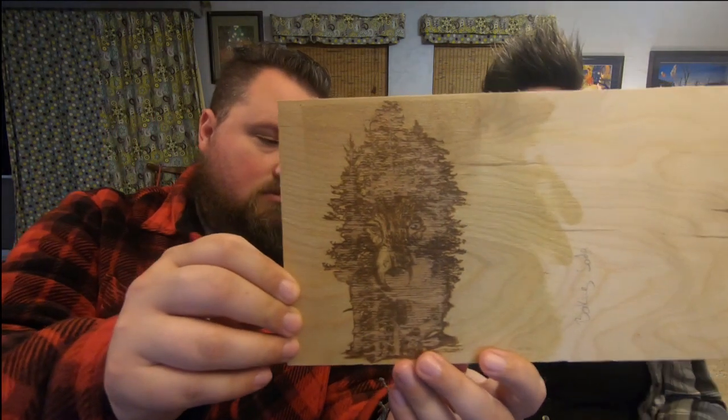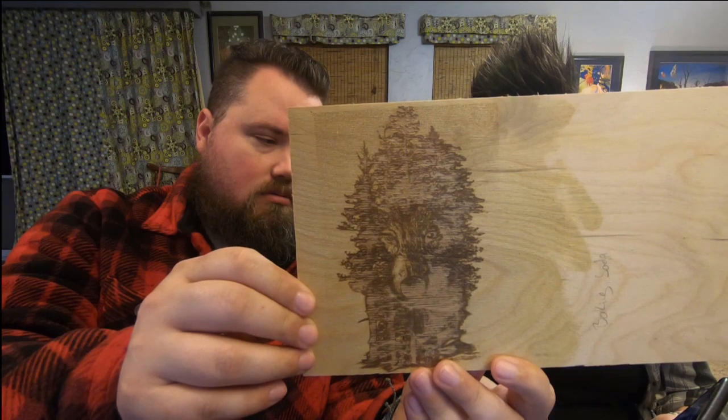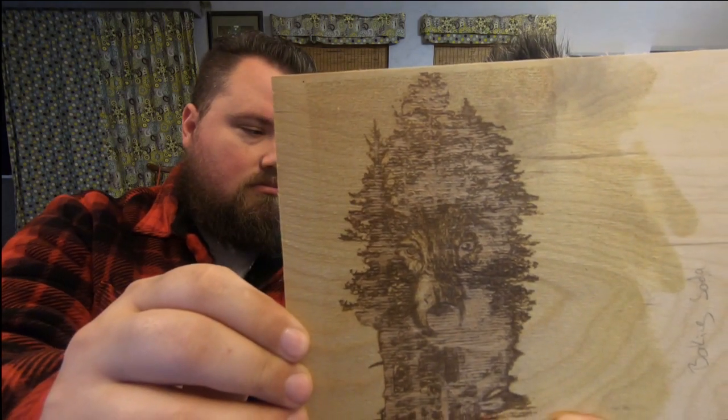We thought why don't we also try a little baking soda and Borax like we've done before. Here is our baking soda result, and it's pretty muddled — hard to see much definition unless we're really close. The reason that happened is that 20% was too much. What it's doing is actually burning through the top layer and down into the wood. That's going to be really cool when done on purpose, but on accident it made it look bad — it burned away what should be really dark.